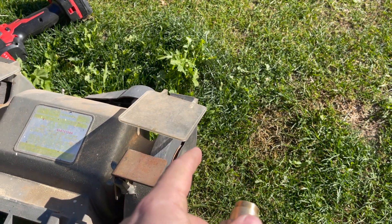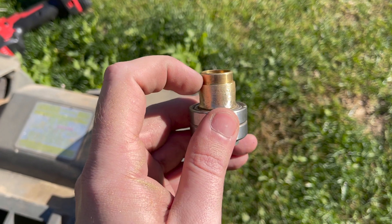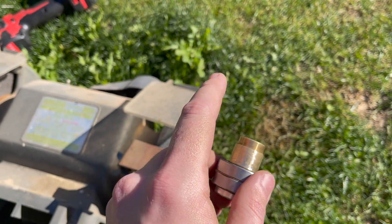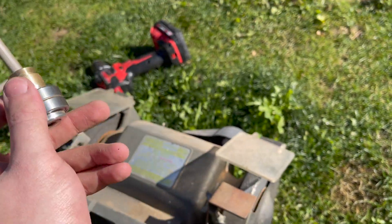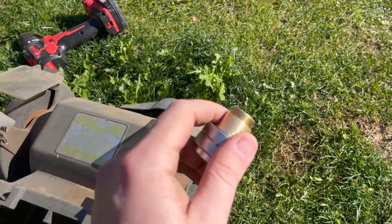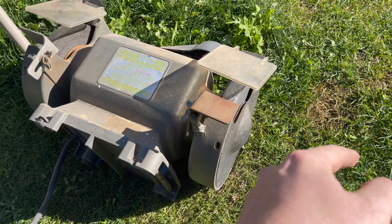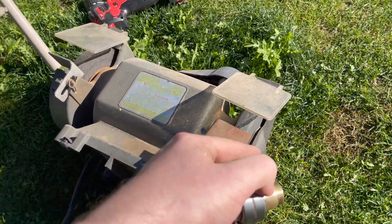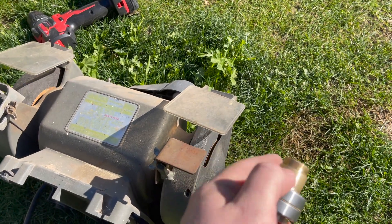It's not the prettiest but I'm probably never gonna look at this again. Really important: test your fit all the time between passes. Brass is really soft, so you're gonna move a lot of material really quickly — just do a little bit, check the fit in the focuser, do a little bit more, check again. Also this is gonna send stuff everywhere, so don't do it near anything sensitive.